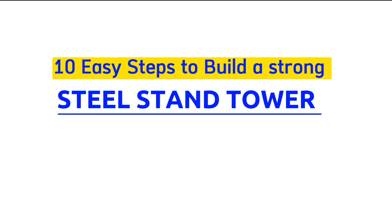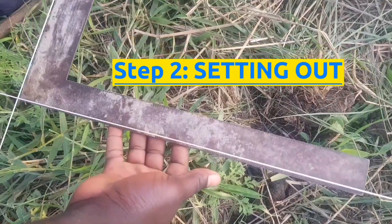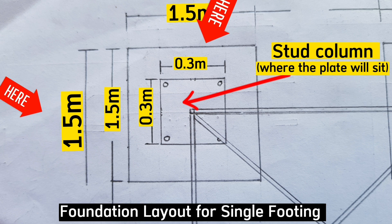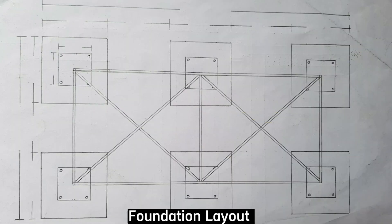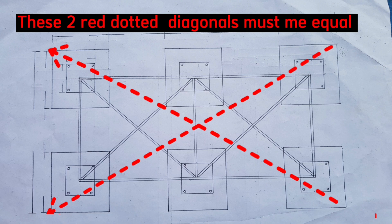We are going to break down the whole process into 10 steps. The first step is to do general site clearance and removing topsoil not exceeding 250 millimeters. The second step is to set out the foundation for the tower. Following this drawing, the foundation plan details a full external length of 6.5 meters and full external width of 3.5 meters. Each pad or base is 1.5 meters on all sides. If you have a smaller tank, you can reduce to 4 pads instead of 6. Remember to leave at least 1.5 meters away from property boundaries, buildings, and large trees. Also, ensure accuracy with diagonals when setting out this foundation.